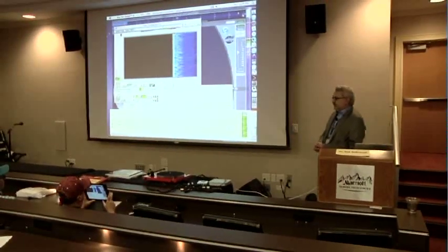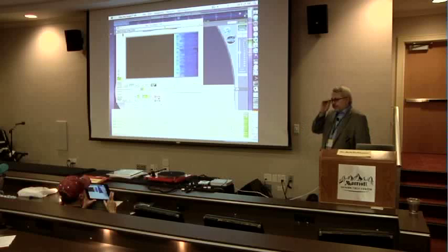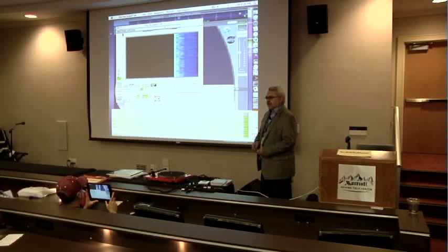I'll get your question in just a second. Okay. All right. The other parameter is resolution, bit depth. Again, you'll see people on the internet saying, well, LPs only have a dynamic range of 60 dB, or 70 dB. Why would you want to use higher than 16-bit, which more than encompasses that dynamic range? 16-bit audio has a dynamic range of 96 decibels. The reason is not the dynamic range, it's the resolution and the precision of capturing each sample and getting the amplitude exactly right. The steps are smaller. And we don't really care anymore about having bigger files because we have adequate hard drive storage nowadays.